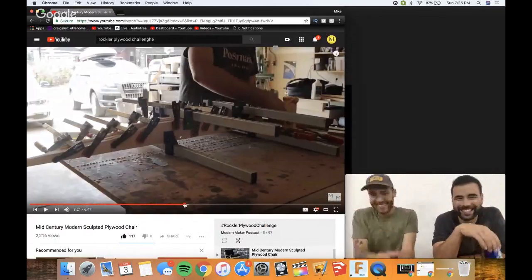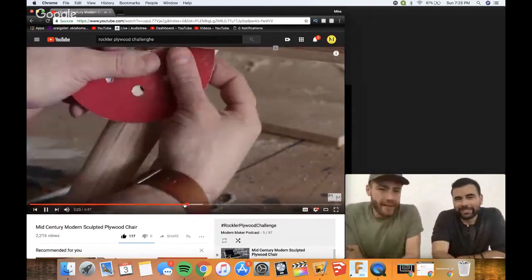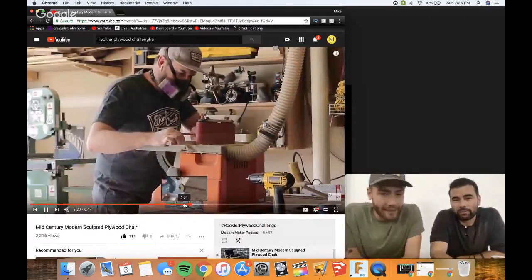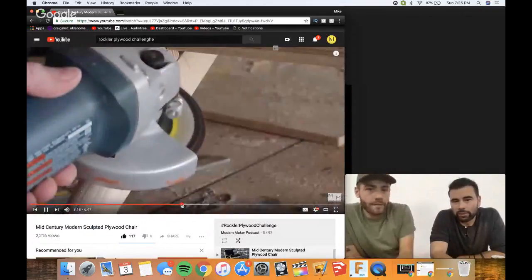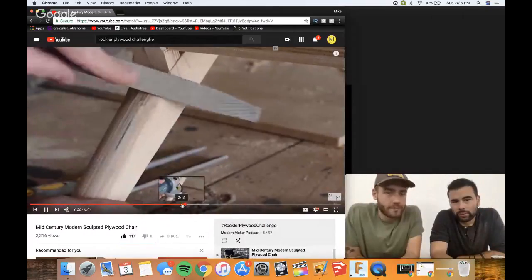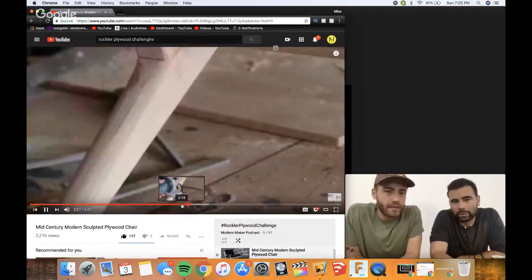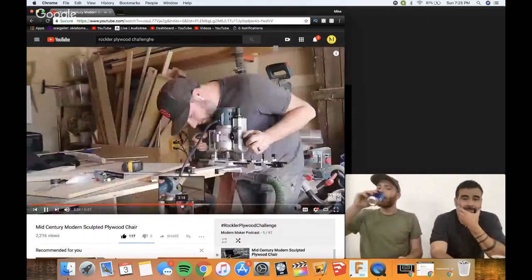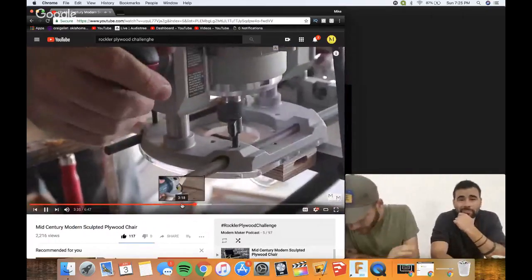So this is where we were talking about rasps and files the other day. I really made it a lot easier to pull apart by hand. Leaving it loosely fit together made it smoothed out all those joints. For the sake of time, I put my hand grinder with an 80 grit flat disc to work, which worked great for a bulk of the material. Sometimes you just gotta throw in some elbow grease, as well as some of the fine shaping, as well as inserting the slots in the seat portion.